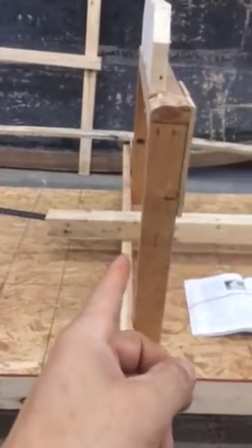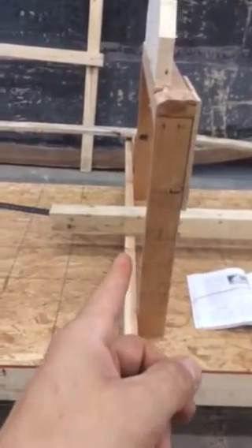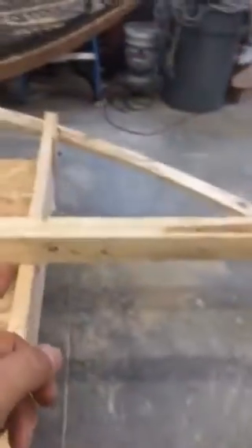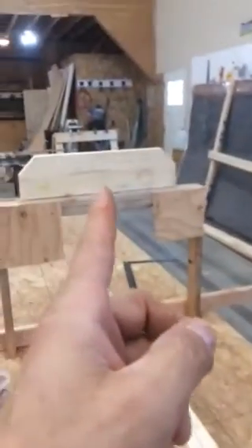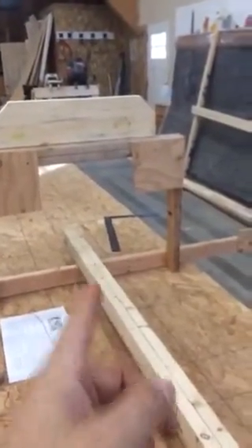I put this jig and I mark the center of each jig piece exactly centered, then I put it on that chalk line — it's in the middle of the boat. You get everything centered, and you do the same thing there. You mark center on your buck.